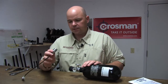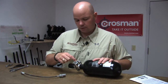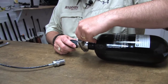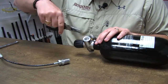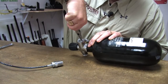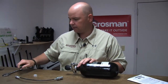The first thing we want to do is attach our hose. In order to do that, you're going to have a cap that is placed into your DIN 300 fitting for shipping purposes — you need to remove this. If you can't quite pull it out with your fingernails, a pair of needle nose pliers comes in real handy. Carefully grab hold and pull it right out. That's just there to keep stuff from getting in there during shipment.